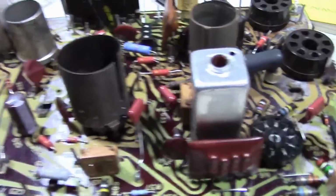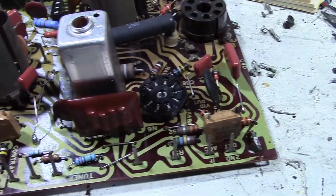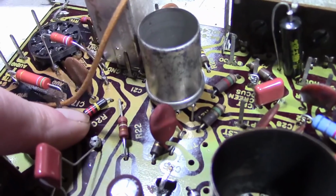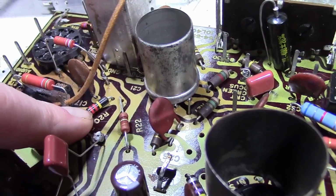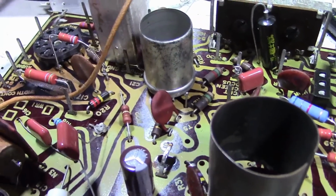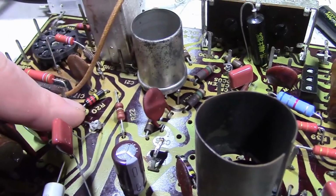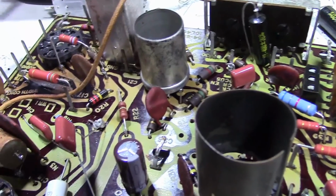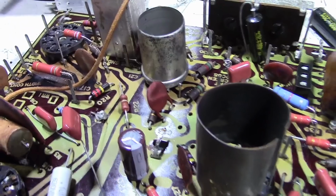And as far as tolerance, there's a range on these boards. Some of them have no fourth band like this guy, meaning it's 20% tolerance. So it can be pretty far off in value and still be acceptable. Tube circuits are very forgiving. This could go up as much as probably 300 plus K, and it'd make very little difference in the circuit.